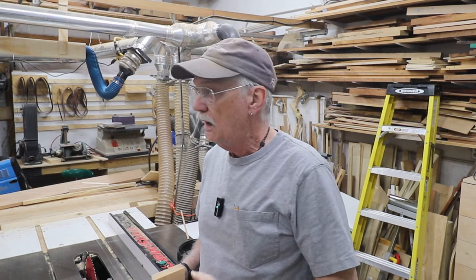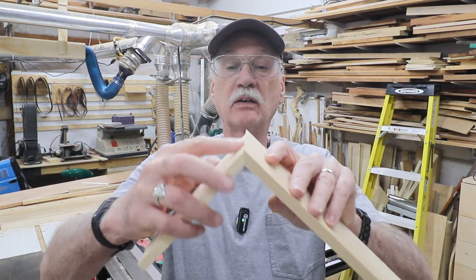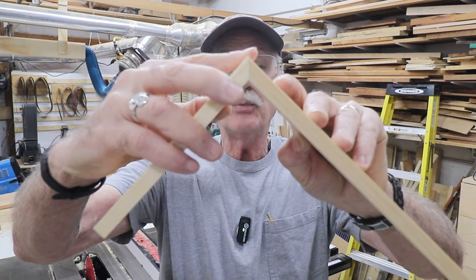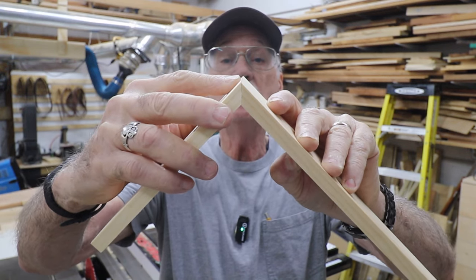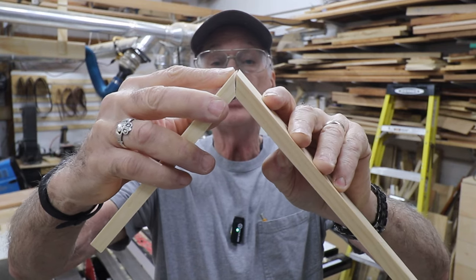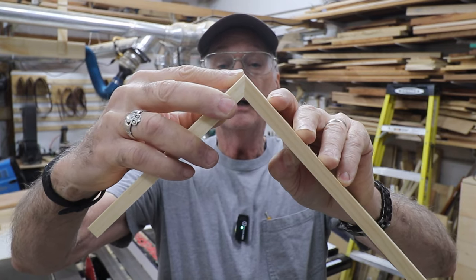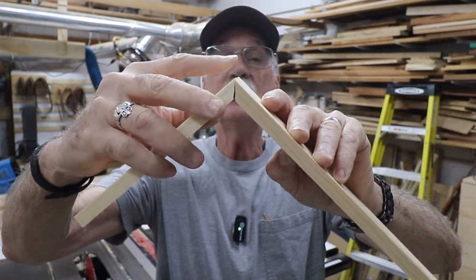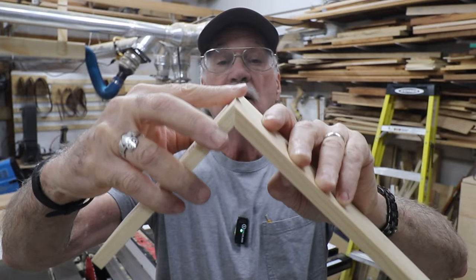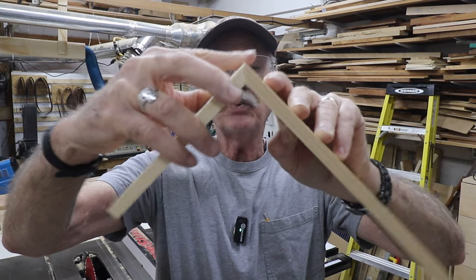The little tip on miters I learned from another YouTuber is how you set up the saw — chop saw, table saw, it can be the same either way. So if you have a miter joint and it's perfect, you have no gaps in the joint. But if it's a little off — if you cut it a little shy, a little too wide — you get a gap. What you want to do is go a little shy of 45. So it's kind of open to the inside of the box. That means this joint here is going to be really tight. If you do it just a little bit, the clamps will close that inside joint up really well. So let's go ahead and set up the saw blade and show you what I'm talking about.